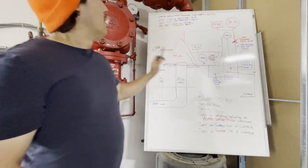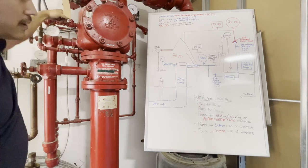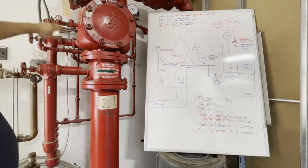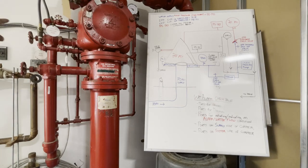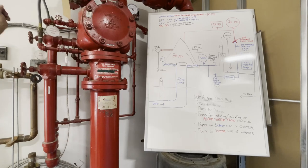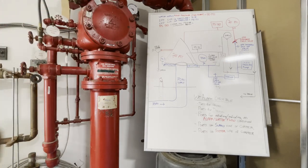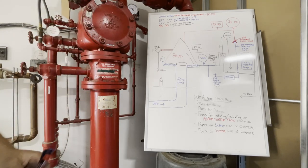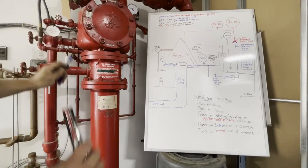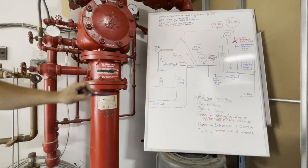I will open my excess pressure pump discharge shutoff valve, which is normally closed. I've got a switch on the wall to the left — I would turn this on. If we watch this gauge for a few minutes, we'll see it start going up. However, eventually that relief valve will let go if I just let it keep pumping — so it will stop system over-pressurization.